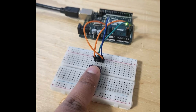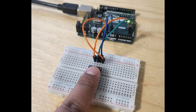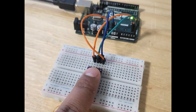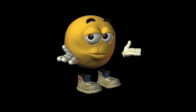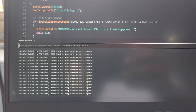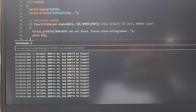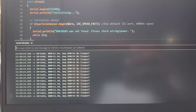Let me make this clear: the MAX30102 heart rate sensor needs firm pressure on the skin and is usually placed on the fingertip for minimal skin depth, which allows ease of penetration for good data. But we are going to use it on the wrist — I know that's not what it's supposed to be used for, but hear me out. Simple project, you can ignore the complicated stuff. The code and module work just fine, as you can see on the serial monitor in Arduino IDE printing the average BPM readings.